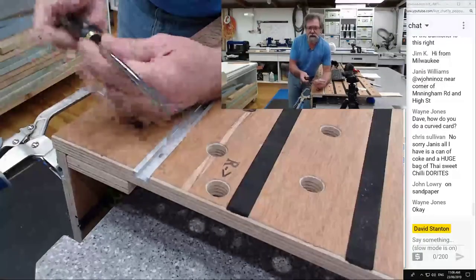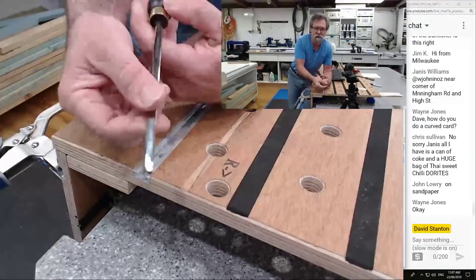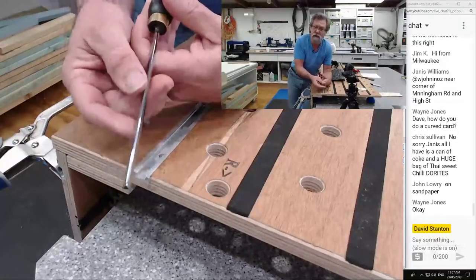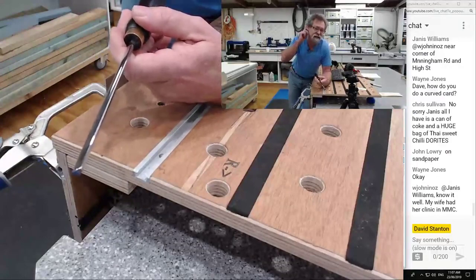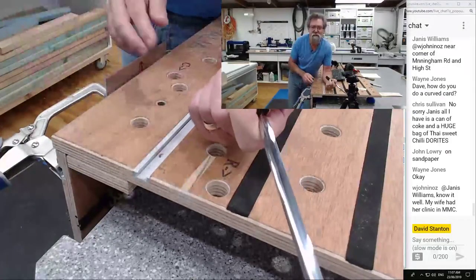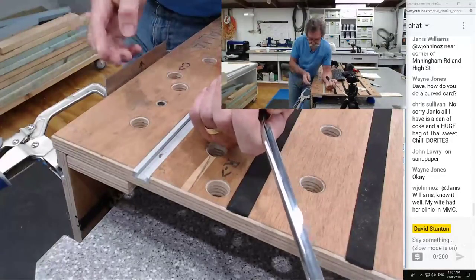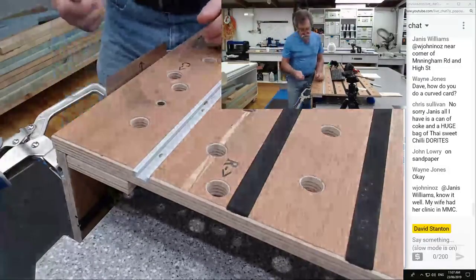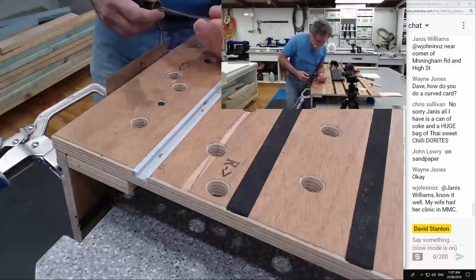Now, the next thing to do is to put a bit of oil on this. We don't have to use a massive amount. It can be a little bit of WD-40 or even grapeseed oil. In the packet, it says rub your finger behind your ear and rub that on the burnisher or on the card. But be careful that you don't cut yourself on the card, because we've just made very sharp edges there. But no hook.